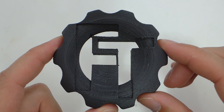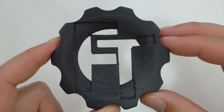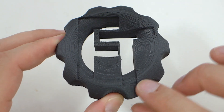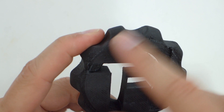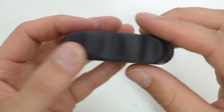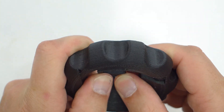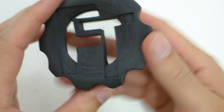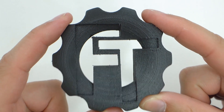Finally, we have carbon fiber ABS by Push Plastic. This is probably my first actual successful ABS print using the enclosure on the FT-5. It turned out great — it is super light but also super strong. I believe I over-extruded just a little bit and could have dialed it down, but over the supports came out great, side walls were great, and it is super strong. I can't bend or break this at all. I'm not an ABS person but it turned out absolutely fantastic — good job Push Plastics.